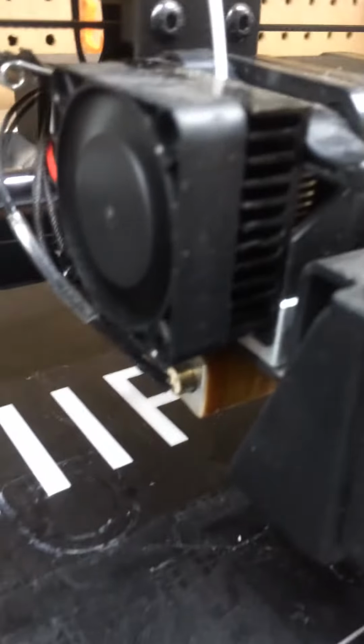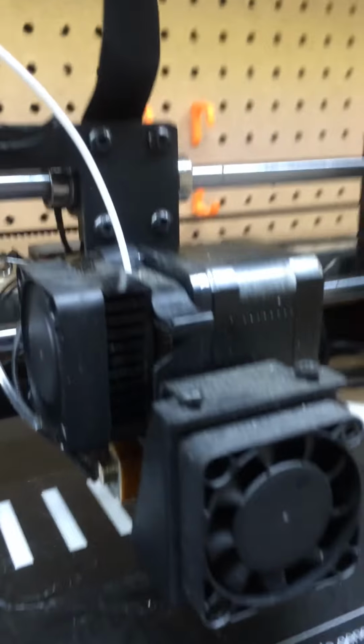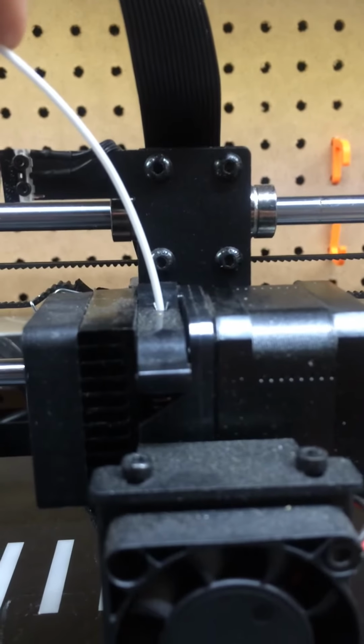And it's basically a hot glue gun. And if you look at the tip, that's the hot bit. So the plastic goes into the extruder. It's heated up to, well, for this type of plastic, about 200 degrees. And then it squirts out the end. Now it squirts out because there's a little motor, a drive motor, in this head.